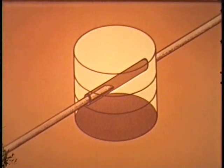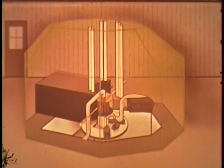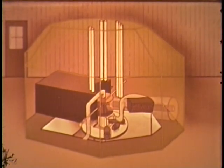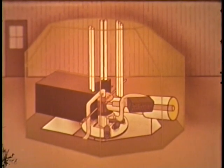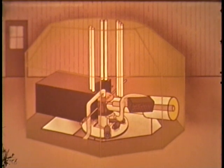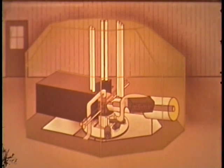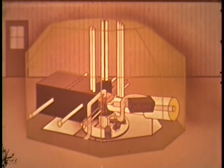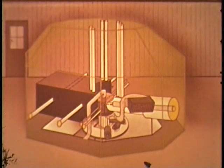A two and one-quarter inch hole extending to within one-half inch of the inner surface of the blanket provides a neutron beam to be utilized in the development of spectrometric equipment. A one and one-sixteenth inch grazing hole passes completely through the blanket for experimental flexibility. Two horizontal holes, approximately two and one-half inches in diameter, pass through the thermal column for evaluating counters in a thermal flux.